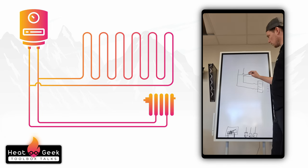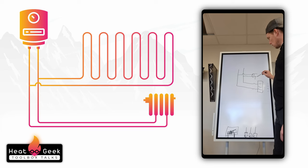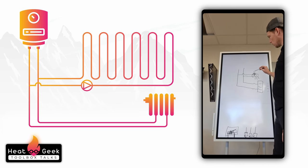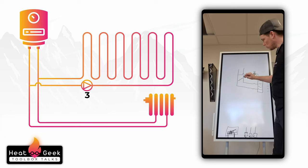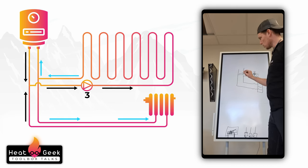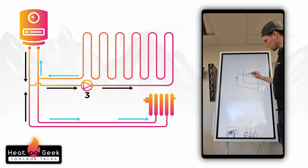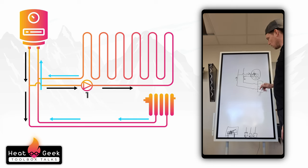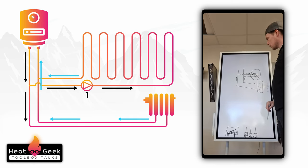We generally rip that pump pack out because they're not working properly — running flat out. Often if you have a higher flow rate for the underfloor heating manifold and this pump is set to speed two or three, it can pull so much that it's pulling more than the boiler can supply. The circuit reverses around the radiators, so the radiator drops in flow temperature, then boosts again when the underfloor is satisfied, then drops — up, down, up, down. We just turn that pump down to one, but generally we're removing all of it and putting in weather compensation anyway.